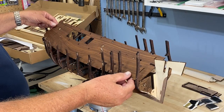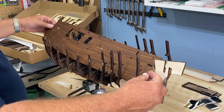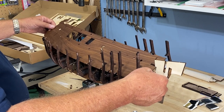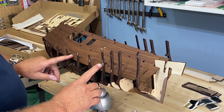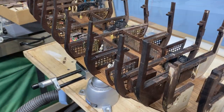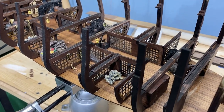I'm in the process of test-fitting the middle deck — you've got to get it down low to get this notch to match up. This is just a test fit; I've got another rib that comes up through here. You've got to do that at an angle, then it'll slide in. I also filed these down a little bit to make them just a hair wider. I think I have the lowest deck ready to go.